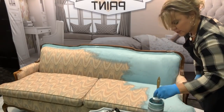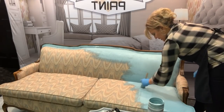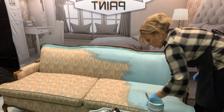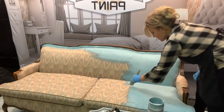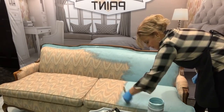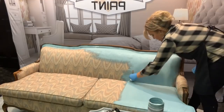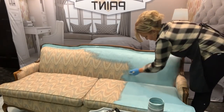I'm trying to really do this well so I can get by with one coat, and it looks so good. Painting with the direction of the fabric helps it go into the weave quicker. If I were ordering paint to do a sofa of this size with removable cushions, I'd get two quarts — you don't want to run out midstream and you don't want to change dye lots in the middle of your couch.